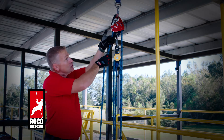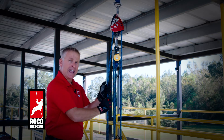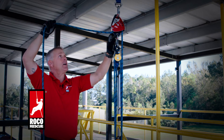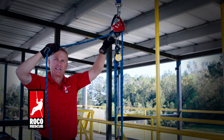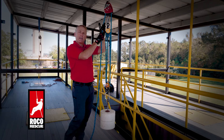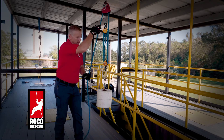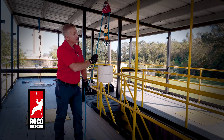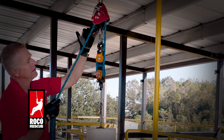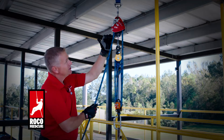When I go to haul on this system, the one downside we've found is that traditionally in a block and tackle we don't haul straight down — we set up that high point and pull to the edge. When I pull to the edge, I get a little friction on this device. Pulling down gives me a bit more efficiency with this block and tackle. I can haul, collapse it to two-block, and lower the device just by pulling that lever.